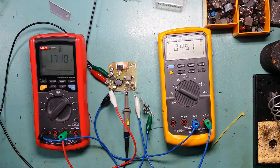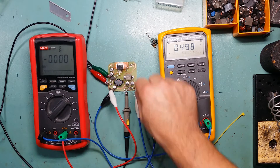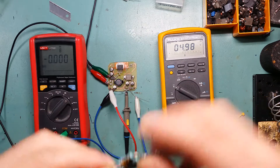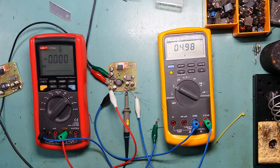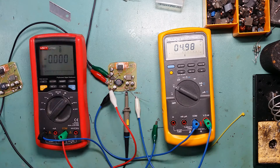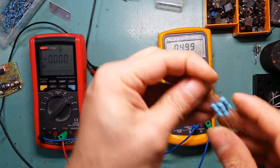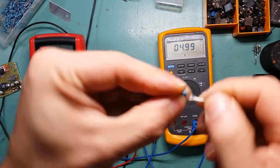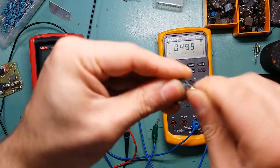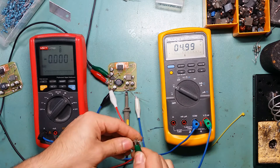For the load on the output I'm going to use some resistors, since a dummy load can sometimes induce extra noise into the DC-DC converter output. For this test I'm just going to use one-watt, 10-ohm resistors — four of them connected together — and I'm going to use my multimeter to show how much current I'm pulling from the DC-DC converter.